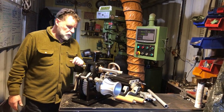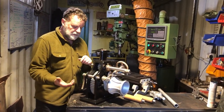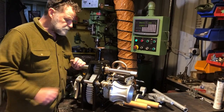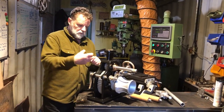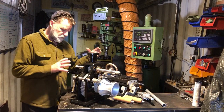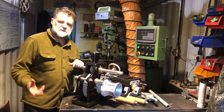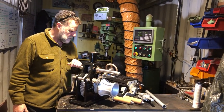These are available as a powered windlass as well. There's a motor and a gearbox below deck, and a drive shaft comes up through the deck snugly against the housing and into a small gearbox by the input shaft, where a set of bevel gears take the drive through to the pinion. That's controlled with a dog clutch so you can engage or disengage the drive and use the windlass manually — it's a fully functional manual windlass, but also with the benefit of power available at 12 volts, 24 volts, and hydraulic as well if the customer so desires.